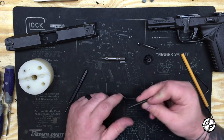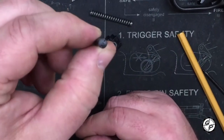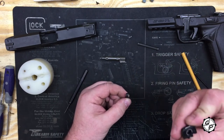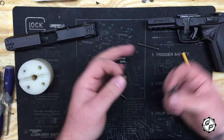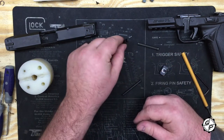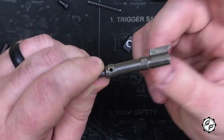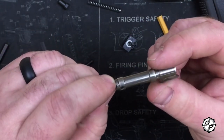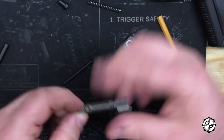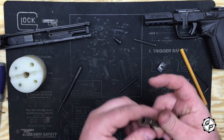We're going to be looking at developing a steel or aluminum striker indicator, rather than the plastic one. The plastic one's a little unique in that it's got these two notches — they don't really serve a purpose. There's a standard sleeve for capturing everything and then a very simplistic striker. When we get to the innards of the pistol you'll see where the blocker actually is. This does have a blocker, but it's a camming blocker rather than an actual striker blocker that would normally be in the slide.